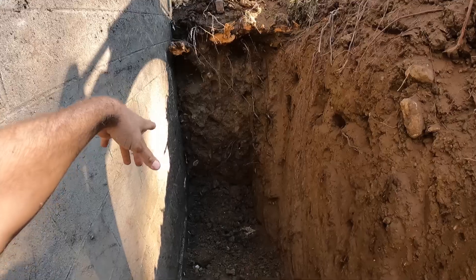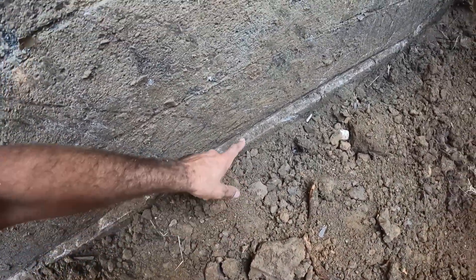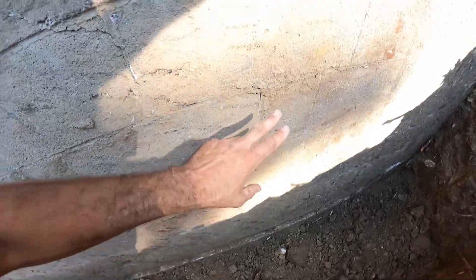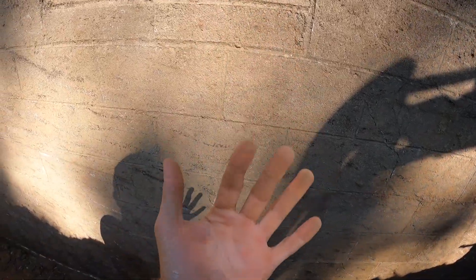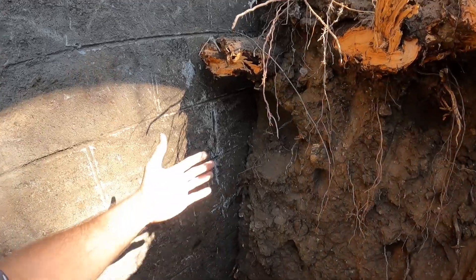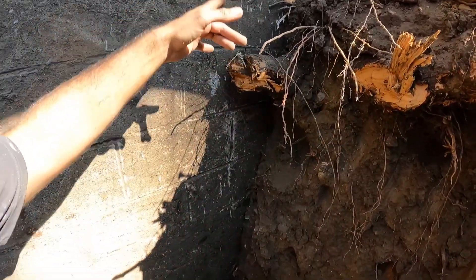Alright, so there's the excavator. You do not want to dig the bottom block — you want some weight to be against that. Right here is my shear mark, so hopefully I can get this pushed back. You can tell how much it's came in. This end's bad. I try to leave a little bit of dirt down here on the end to keep the corner together, because if not you're going to blow that corner out and push it out of the other corner.